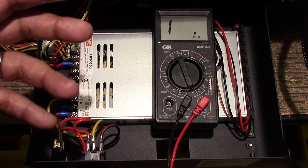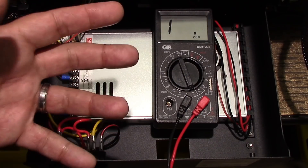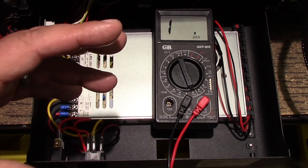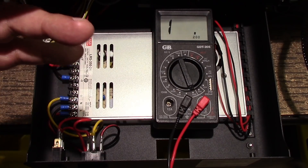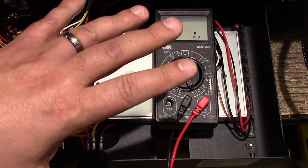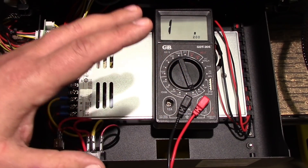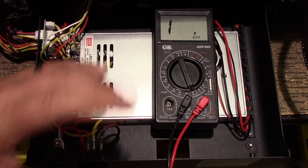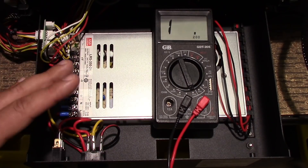I did a video on this for the laser cutter, because the laser cutter depends on its high voltage power supply having an adequate ground. A lot of people bleed the laser's ground into their home electrical system, which is just bad. This is the huge importance of having a good ground in your home. The second thing is: if like in Angus's case you are shocked by something, unplug it immediately — do not let it run.